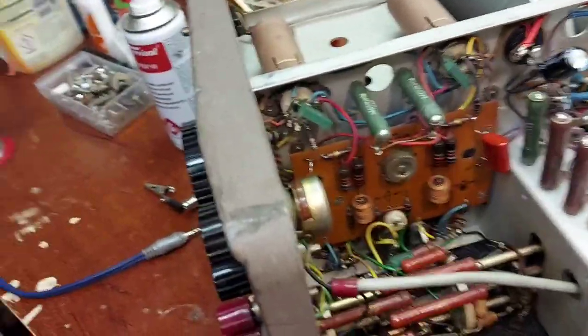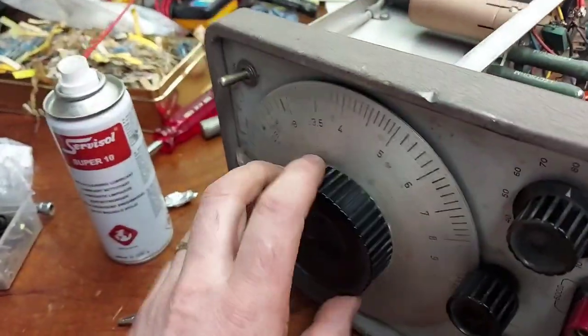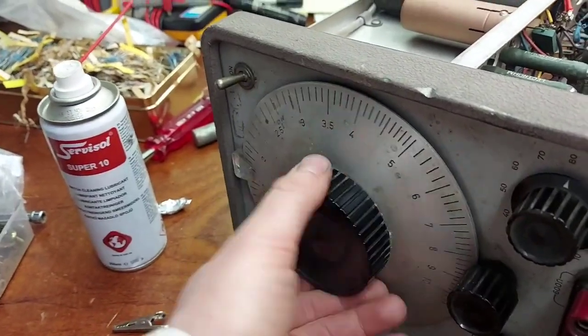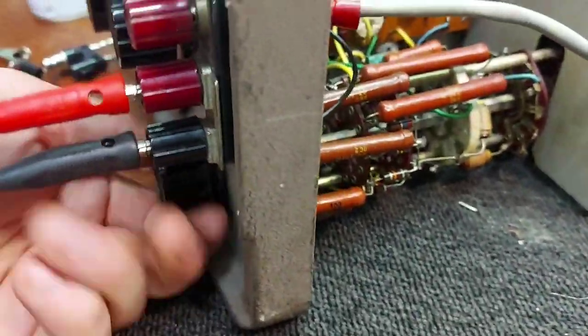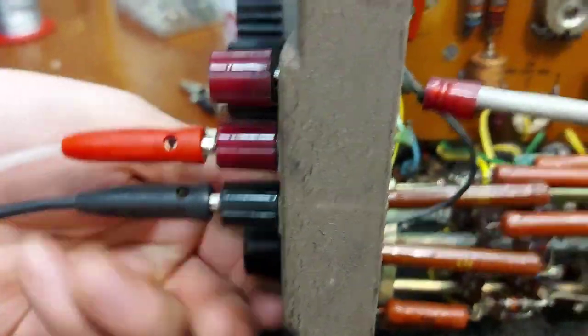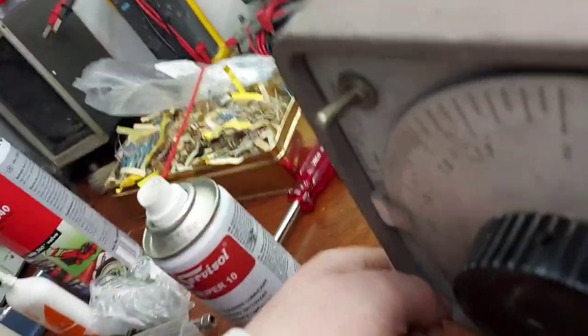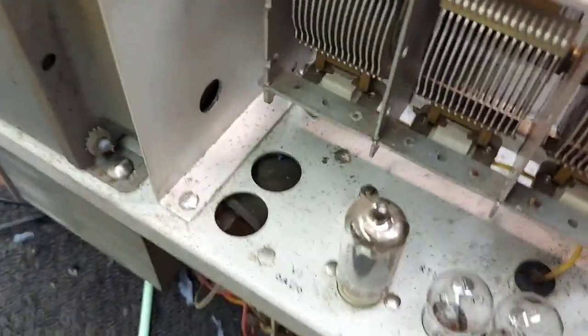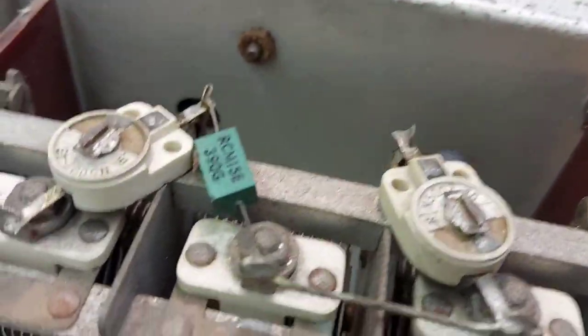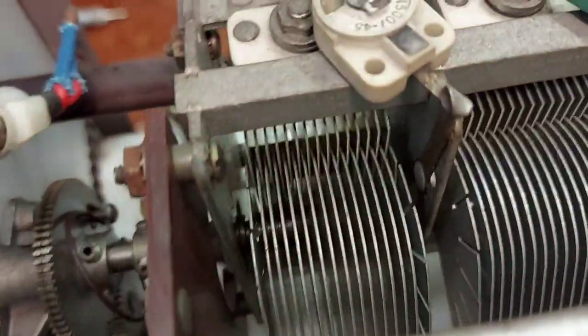I have the two caps in and the board put back on. I've lubricated up the mechanism and it's lovely and free now — working very nicely. I've cleaned all the contacts on the range switch and lubricated the two detent balls, so it turns with a nice click to it now — it was a bit stiff before. I've cleaned a lot of the dust off it because it was absolutely filthy, so it's a bit cleaner looking now. I've also lubricated the variable capacitor — the ball races either end of the shaft — and cleaned the ground contacts.